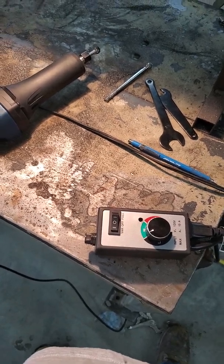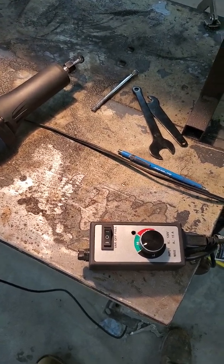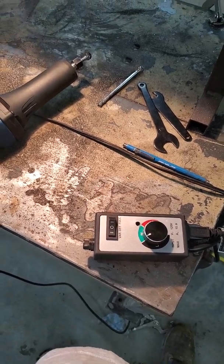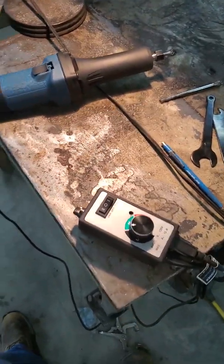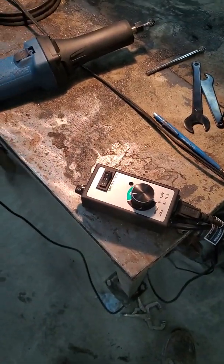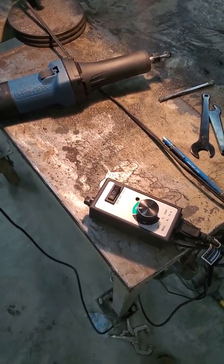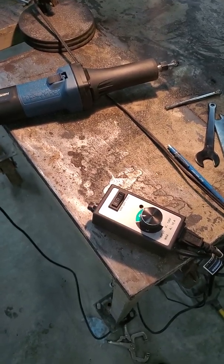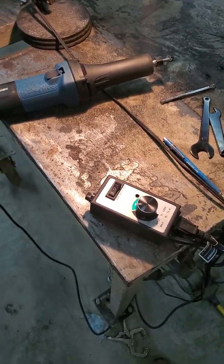But it's workable. When you've got a long cutter, they don't want to go as fast because they can get wobbly and vibrate, which is not good. This beats listening to my air compressor running 24/7. A $16 air die grinder is cheaper than a $70 electric die grinder plus a $30 speed controller, but for $100 if you've got nothing and don't have a good air compressor, it's not a bad way to get in the game — you're still going to spend money on cutters anyway. I'm actually pretty surprised with how much I like this. I haven't gone back to air since I got it. Longevity-wise, I don't know — time will tell.